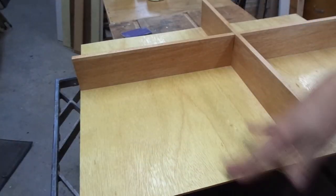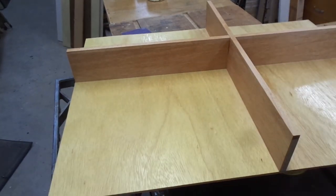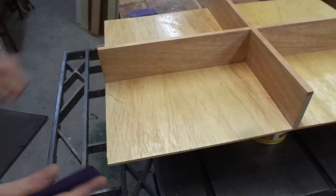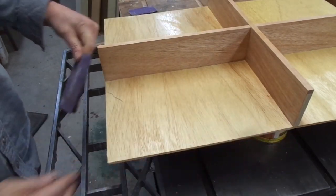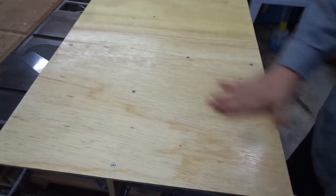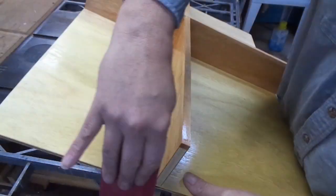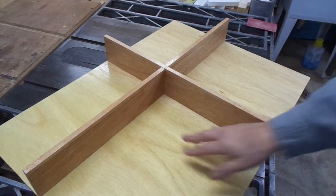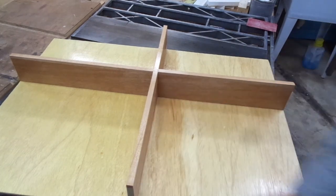The first coat is on. I could sand it but it's just easier to scrape it and you get similar results. I am going to sand the edges lightly — they're a little too rough to scrape. It's got two coats of oil polyurethane on it now, I scraped it, and it's feeling smooth and sealed.